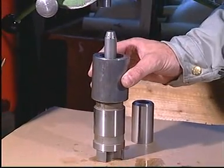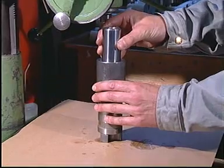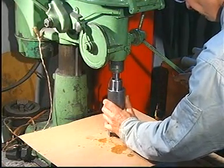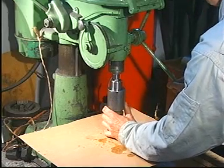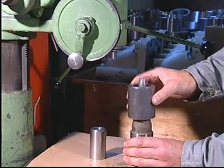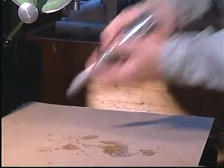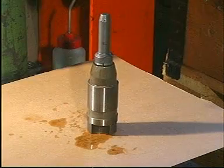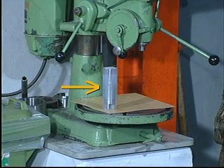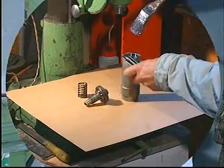Place the parts on the plane of a drilling machine and mount the special tool. Then press the parts firmly together. Check once again that the cutoff slide is able to move freely. Protect and handle the spindle guide very carefully, as any rough handling may cause the component to malfunction.